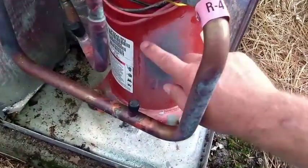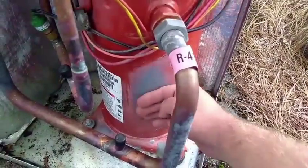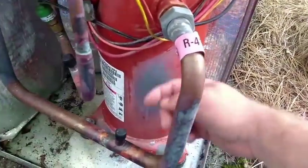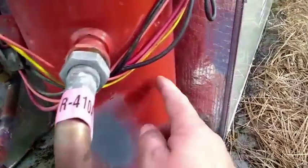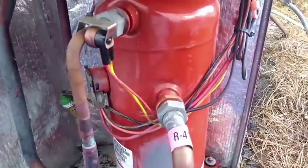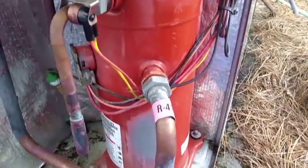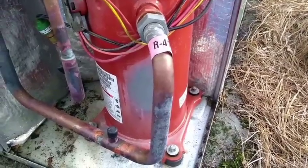Here's an interesting fact — we have a large section here. Now it's warmer; I just tried starting this thing a couple times. It's cool on top, warm right here, and all the paint's missing. So you guys tell me what you think happened right there — I'm kind of curious. There are a couple scuffs where I hit it with the sledgehammer trying to break it free, because we have a locked rotor pulling about 170 amps. Do you think there's something happening down this part of the compressor? I'm not an expert at the internals of all these compressors — I know some of you guys slice them in half every single day, so you tell me what's going on.